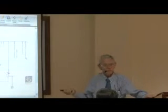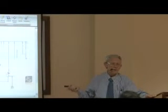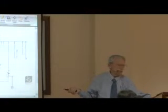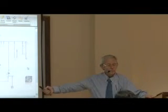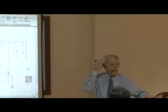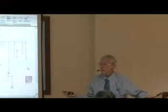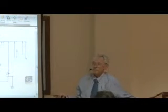First, we'll close this breaker and provide power, or whatever it is, because we need power. And caution, this will be right up at the limit of the short circuit capacity or load flow or whatever it is. So be cautious, or maybe it's beyond it. So don't stand in front of the breaker and do it. Find a way to do it remotely, or whatever works. And go through in more detail. If you were there, you remember a lot of things that you don't have to write down. Maybe you should, but you don't have to. If you are not there, then you must list everything, because some person out in the field is relying on you.